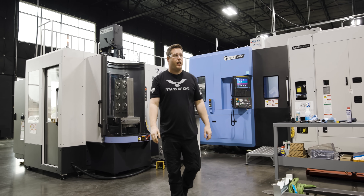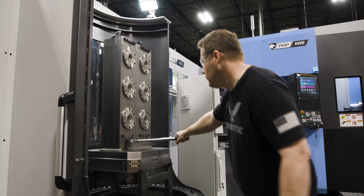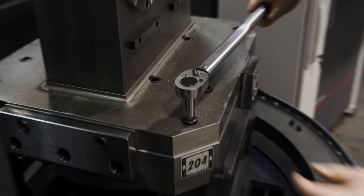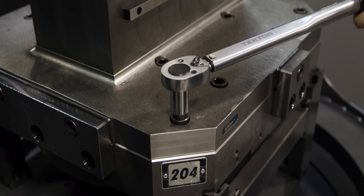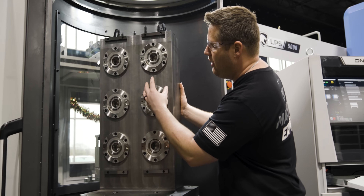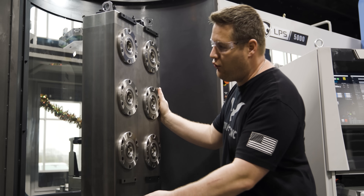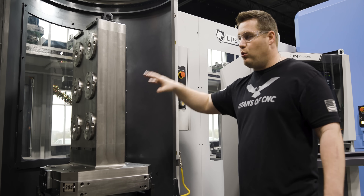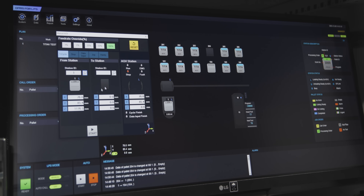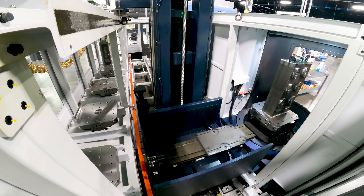I had to get another driver — that last guy was too dangerous. So now we've got our second tombstone mounted. As you can see, this is a double-sided tombstone as well. The big difference here being that we've got Vero S on both sides instead of just one, so this is a super modular tombstone. Now that it's mounted, we'll go ahead and get it staged in the machine. I'm just going to call it from loading station back to 204 and hit start — it takes off.